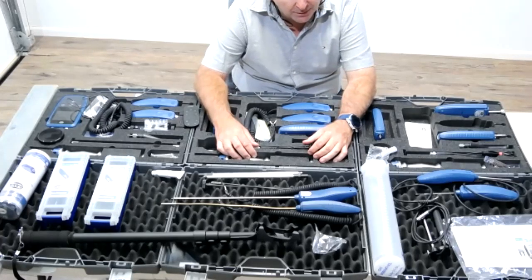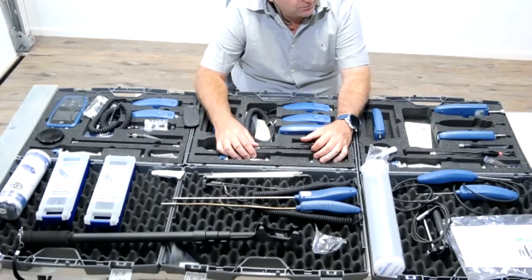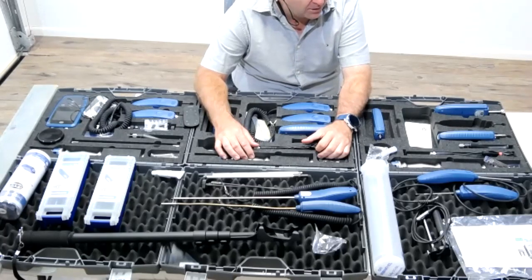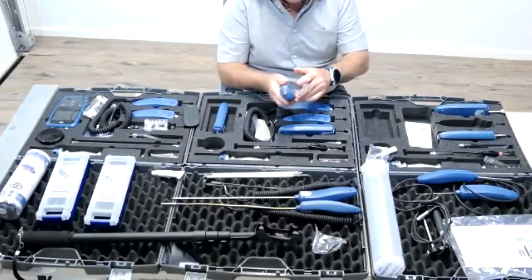We come back in a couple of days, we check the timber floor, and it now reads 12%. But the temperature of the floor is actually 40 degrees. If it's 30 degrees, it will read about 1.5% drier. If it's 40 degrees, it reads about 3% drier. So it's not 12%, it's still 15%, but they haven't adjusted the temperature. So adjusting the temperature is very important. It is, yeah. Fantastic.